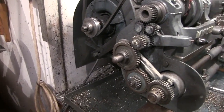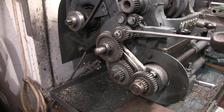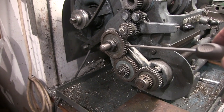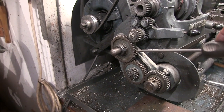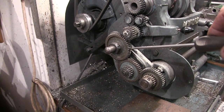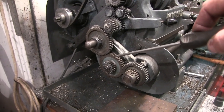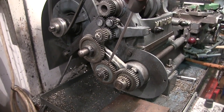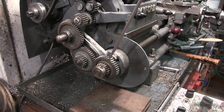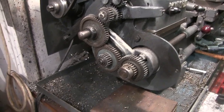So, just in case you're interested, we swapped this one with a 21 tooth driver, which comes off the tumbler. So we've got the 21 tooth driver. Then on this first stud, we've got a 50 tooth driver, driven and then driver, because that's driving that. That one is 45 tooth, then a 40 tooth on the actual lead screw, and that should give us a 1.5 millimetre pitch.